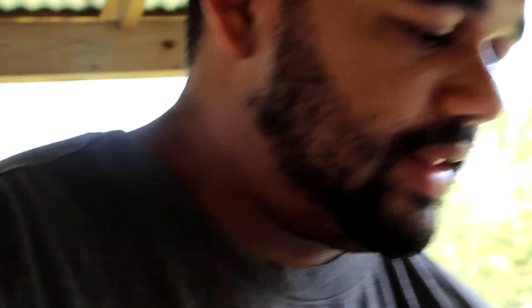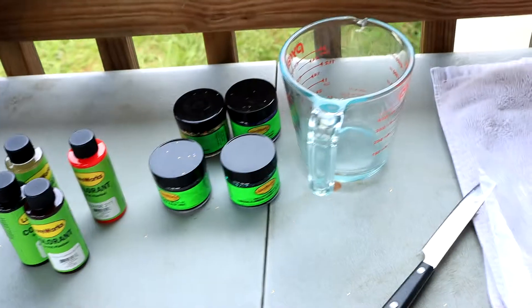You're probably gonna want some type of hardener and some type of salt. Salt's gonna help that bait sink, and the hardener's gonna give that soft plastic — obviously, what it says — it's gonna make it harder. I don't have any hardener and I don't have salt, but I'm getting that next time — I recommend it. You'll also want a thermometer; you want this plastic when it comes out of the microwave to be about 300 to 350 degrees. So let's make our first lure.